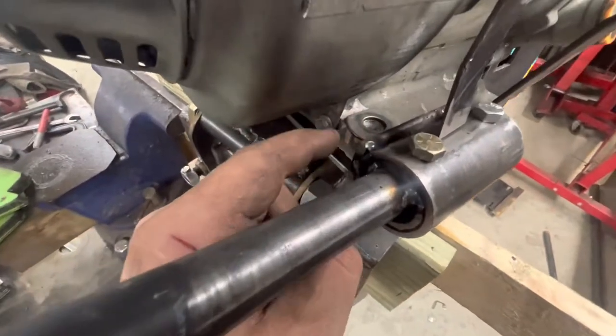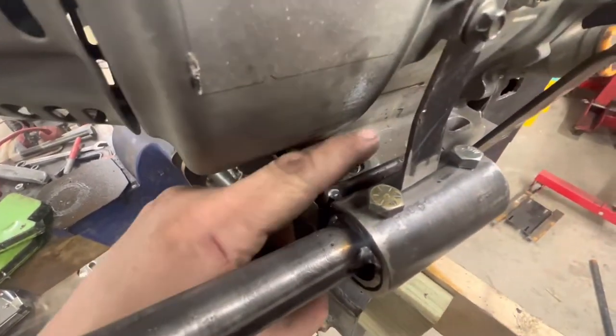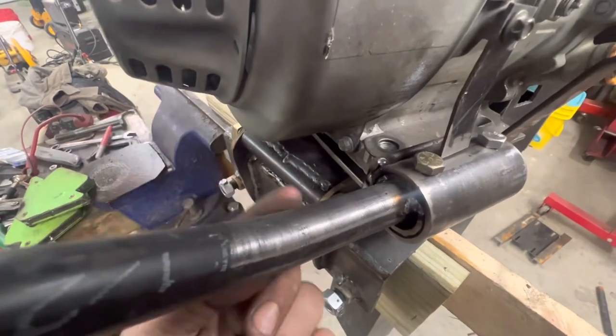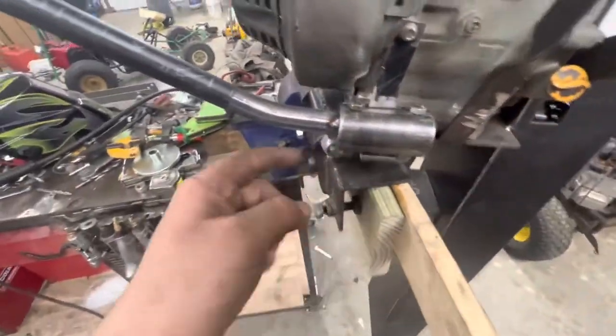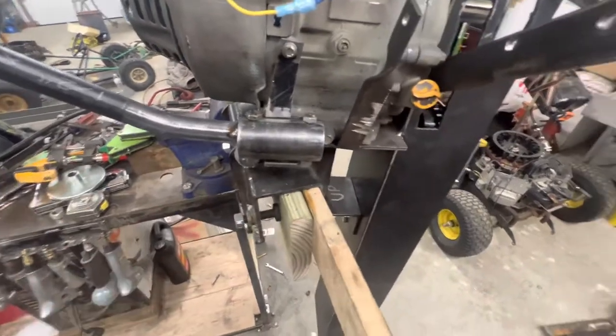Now I'm going to put a couple tack welds on there. I cut this washer down — just put it in the vise and hit it with a file a few times. It hasn't been tack welded in yet, but the bolt's going to go up through it, and when the main mounting bolt for the motor tightens down it'll hold it. It gets tack welded right there and it's filed on the opposite side so when the motor slides out it'll clear everything. Thanks for watching — like, comment, subscribe, check out my Instagram at The Redneck Craftsman, link is in the bio. See you guys later.